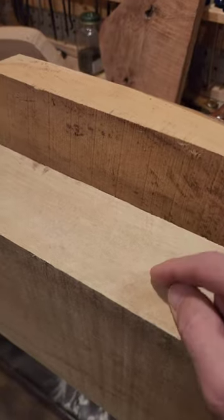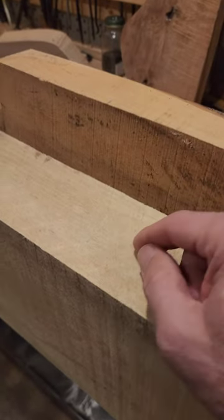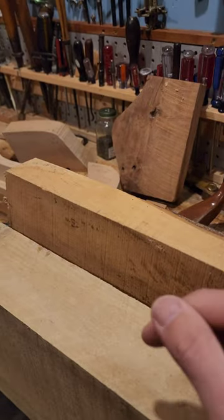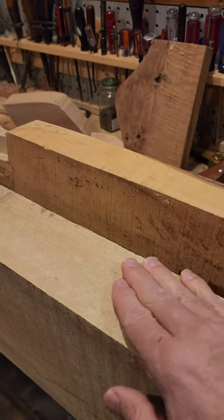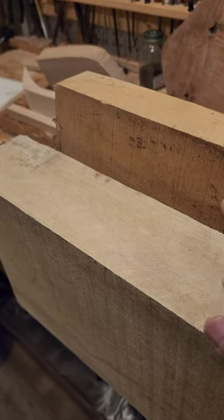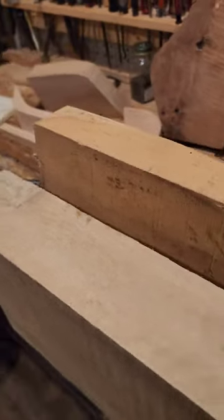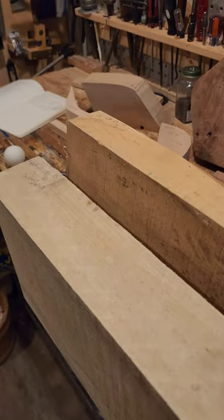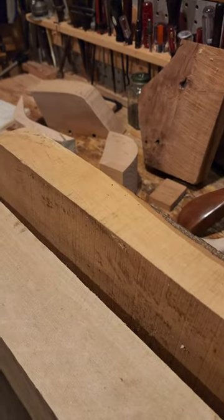The most scientific way is to use what's called a Janka hardness tester, which involves taking an 11 millimeter bead and a hydraulic press to measure how many pounds of pressure it requires to indent that ball halfway in. I don't have that equipment — it's expensive — so I'm not able to Janka hardness test the wood I have. But you can look it up online and get an idea of at least what species to consider.